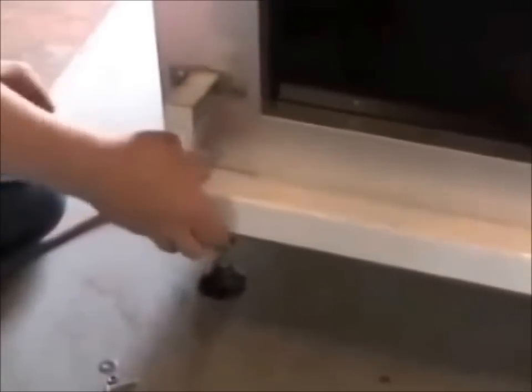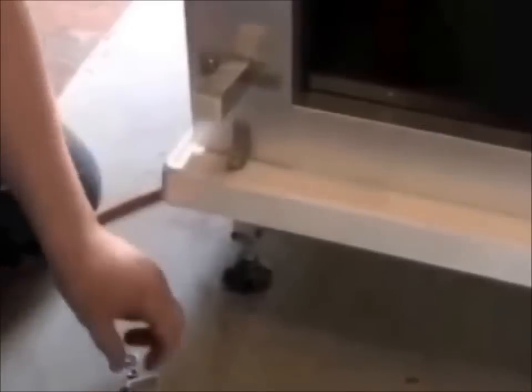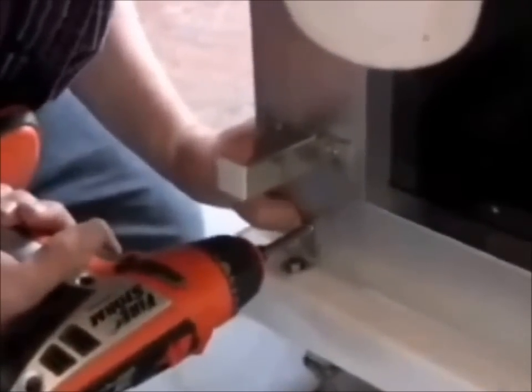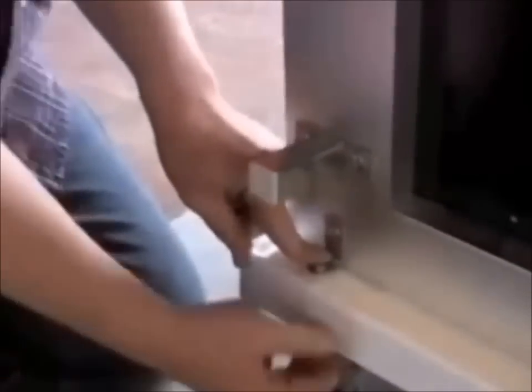Now take your flexible hose — it's going to hook up to the outlet here. On the other side, notice it has a tapered edge because it's going to sit inside the tapered socket for holding the handheld shower. We're going to put supports on the back to have everything squared up and centered. Take the rubber grommet first and press it through, then set this on top. The grommet has to go on the bottom so it presses against the bottom to make a seal. Snug it down nice and tight — that's going to make a seal and hold everything stationary. Do that on both sides.